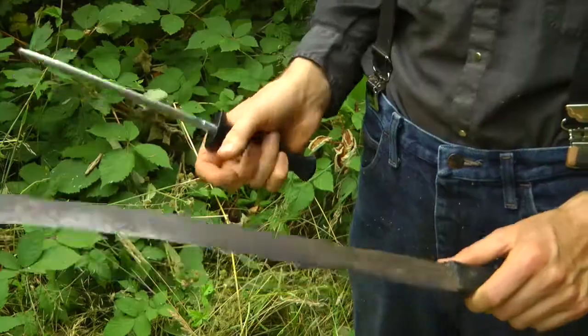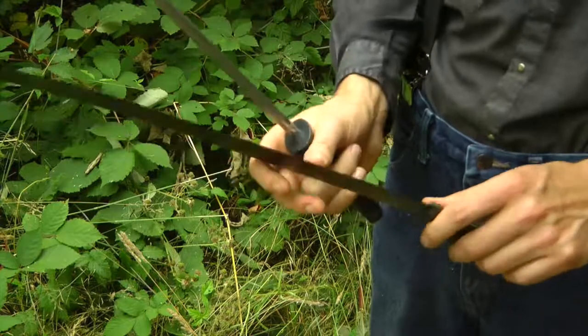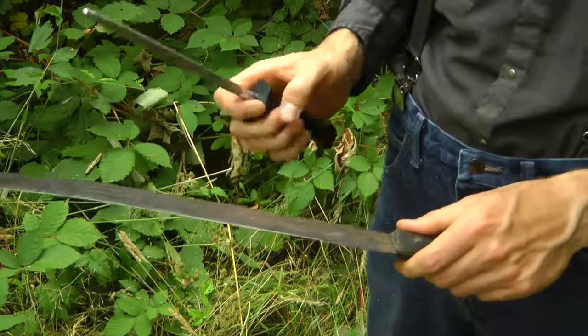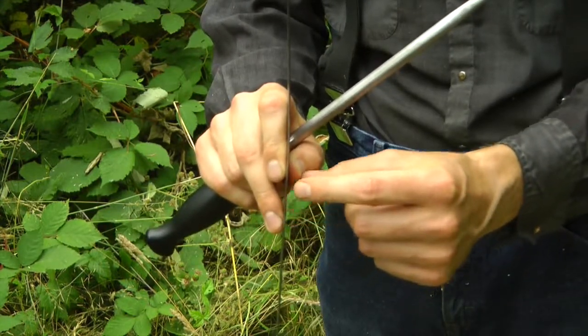It has a rubber tire handle that's been riveted on there with some staples and nails, it looks like. But it's fairly decent as far as the handle quality and keeps an edge very nicely. So the other thing I like to keep it sharp with is, of course, my steel. And this is a little bit more challenging than a kitchen knife, which I think I've shown you in the past how I sharpen my kitchen knives. So there's a little different method of doing it on a machete — very similar to how you keep a scythe sharpened, only I use the steel so it doesn't wear the edge away. It just brings it up to a point again. So this is about a 15-inch machete. I've got the blade quite sharp already, not quite shaving sharp, but very nice and sharp. And you can look down the edge of it and see if there's any kind of shiny spots. There are a couple right up at the tip here.